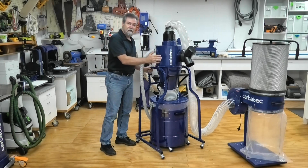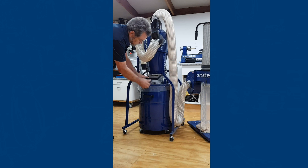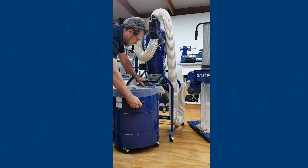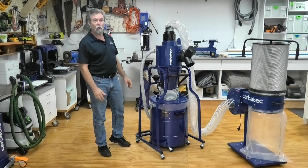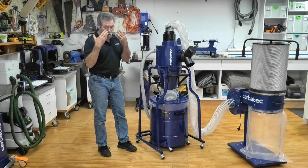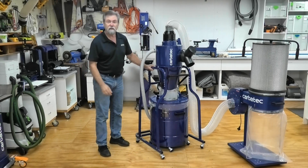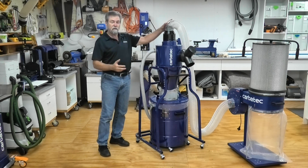This is the big thing. The support frame and lift system makes emptying the drum simple and almost effortless. No more balancing acts to support bags or clumsy accessories, and no more dust spillage on the floor or in your face. The support frame also stabilizes the cyclone inline dust collector against tipping from the weight of hoses connected to the top.